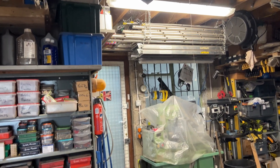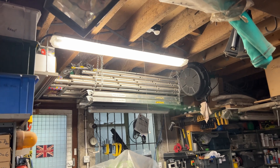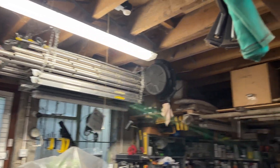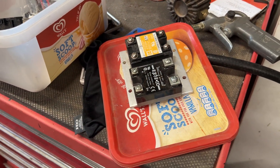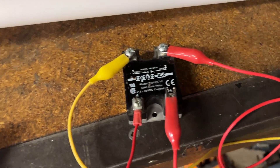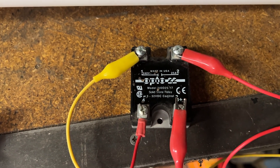What I noticed when the PIR switched off - you could be outside of the garage and look in - and these lights would be blipping. They go puff-duff like this, pulsing. I thought, what's going on there? I looked into it a little bit, and with a solid state relay it's not a true off when you switch it off. There's a certain leakage current allowed on them - it's within tolerance, they're not faulty. But if you're going to put it on your lights in the garage and power fluorescent tubes - the non-LED type - be aware.